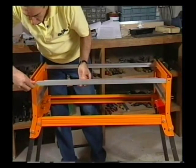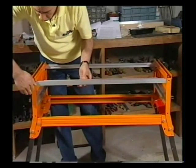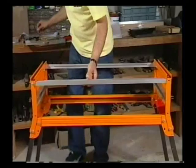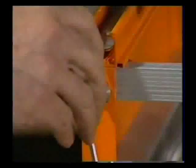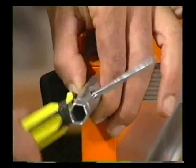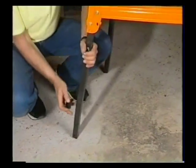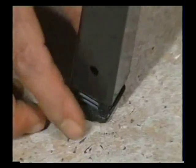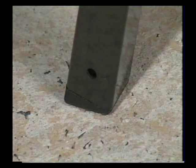You may have to get a screwdriver point and slightly adjust the position of the flange nut. Put the other bolt in for safe keeping before tightening them both up. Tighten these four bolts up quite firmly, but again not to the point where you're going to over-tighten them. Next, lift each corner of the work centre and place one of the small plastic feet directly underneath the open leg in the correct orientation, and then simply push it home like that.